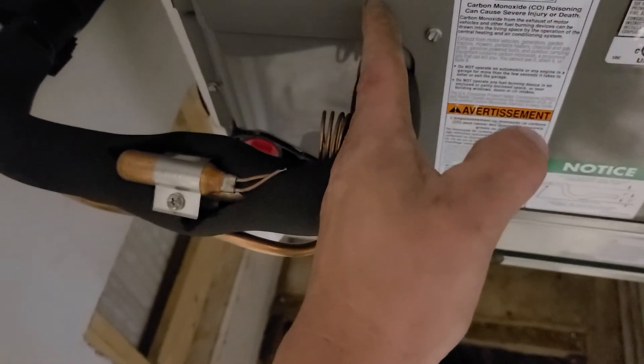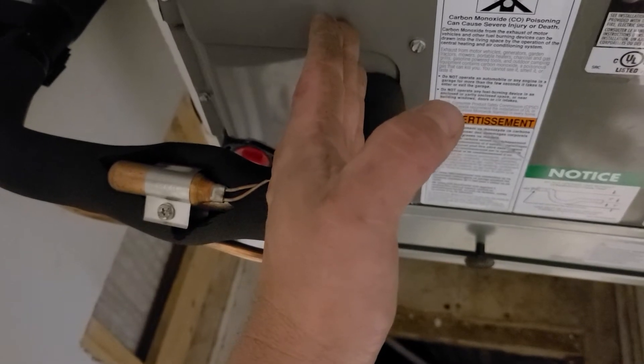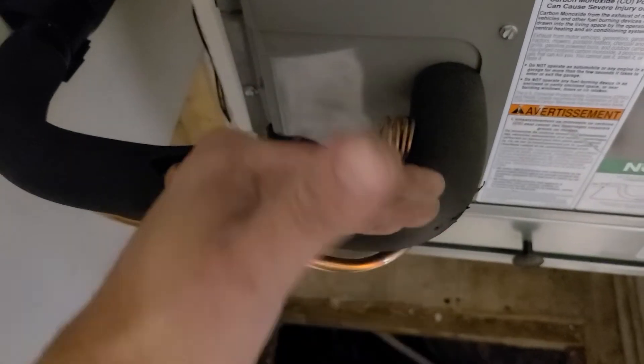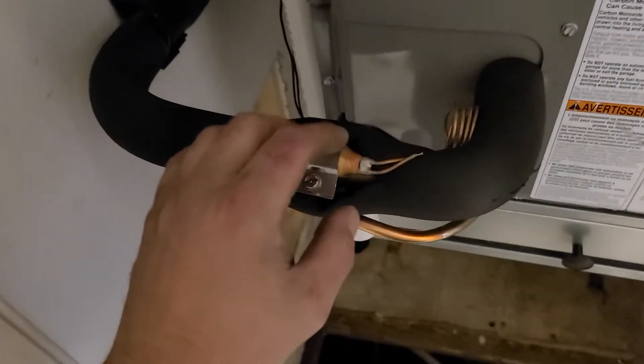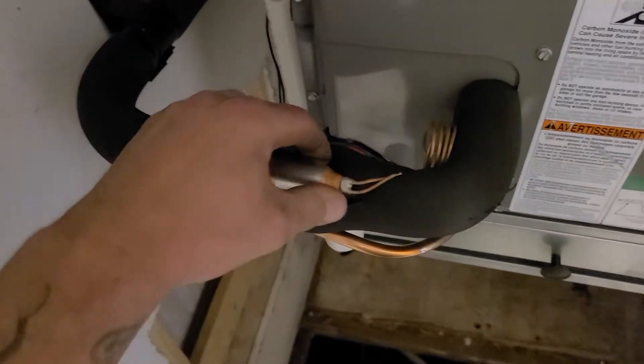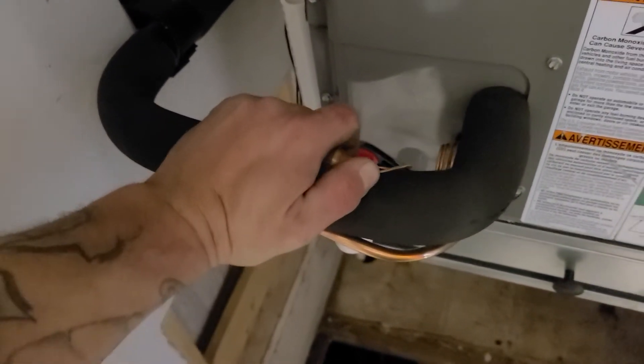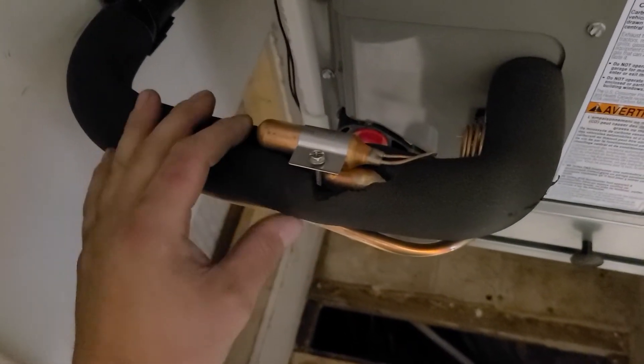So that means 12 o'clock, 11 o'clock, 10 o'clock, 1 o'clock, 2 o'clock. It goes in any direction — whichever way the pipe is, vertical or horizontal, doesn't matter. You put it in either the 10 o'clock or the 2 o'clock position. That's how it senses correctly.